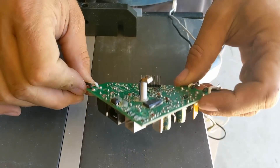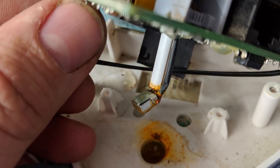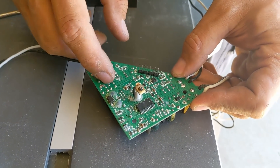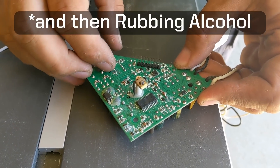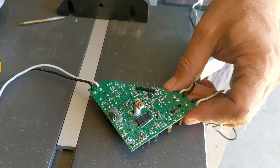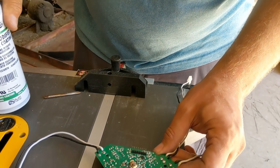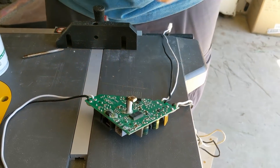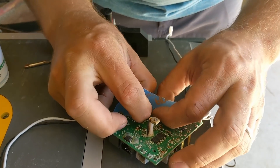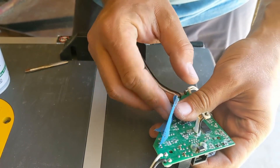Here's the circuit board removed from the fan. This is the infrared receiver that was sitting in its own condensation, and there were little dots of water and corrosion all over the board. I took a toothbrush and water and just scrubbed it nice and clean. When they originally built this they could have easily avoided this problem by using a conformal coating like this one made by MG Chemicals. If you have a Maxair fan and plan on cold weather camping where there's a chance of condensation, I recommend you do the same.